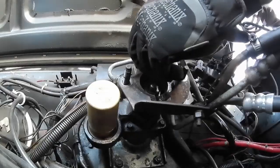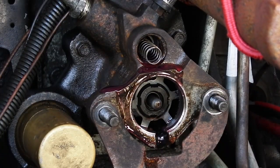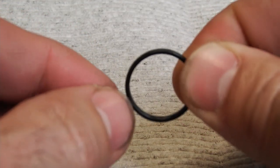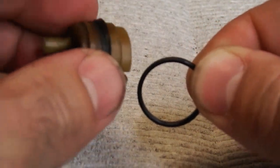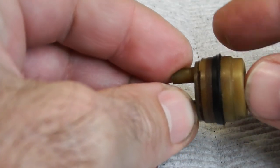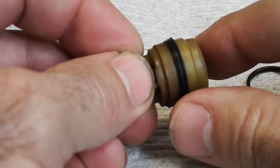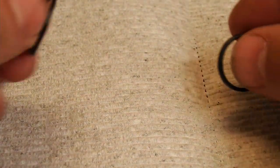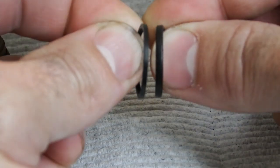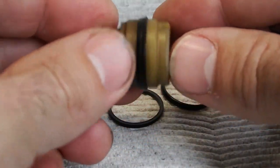Rock it back and forth. Now you can see the spring and it's dumping fluid everywhere. Let me get a rag. This is actually a square O-ring that goes on this thing. I went to Grainger and got two square O-rings that I had to seat next to each other. They were a little bit thinner than the ones that were in there, so two of them together kind of made the right thickness. We'll try putting that in and lubricating it, and see if that stops the leak.